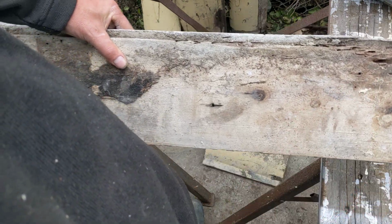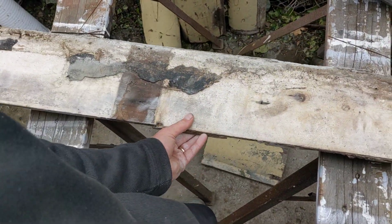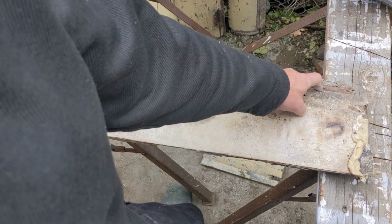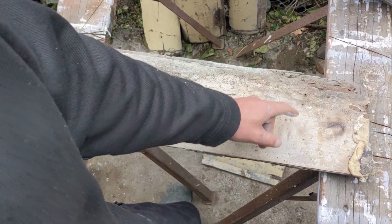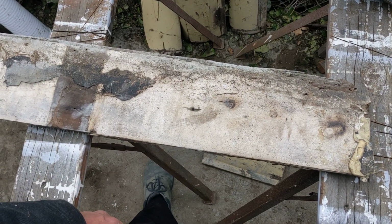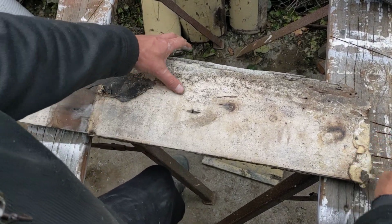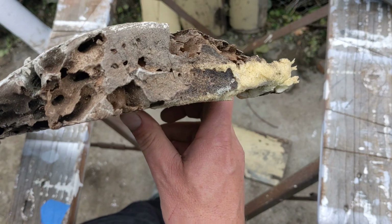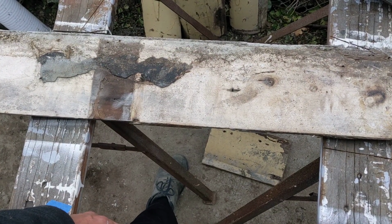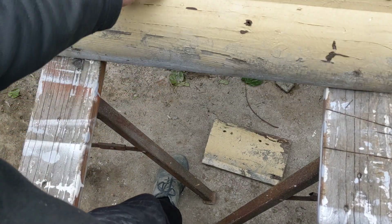And you have to set your standard of how long you want it to last. So some guys will cut, what can you see? Like right here, dude. And then they'll sit here for like 5 hours with some glue. And you can do that if it's like an 1850 Victorian. This is not an 1850 Victorian. So what we want is good wood that's better than Home Depot 2x4s, that matches the old appeal of the house, that provides us some shear strength, that keeps the water out, that does what it's supposed to do.